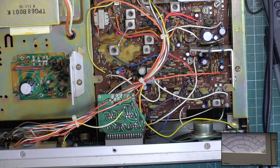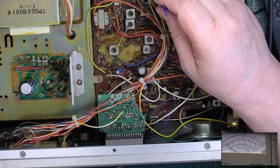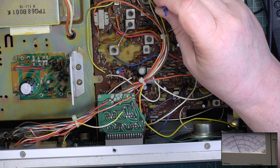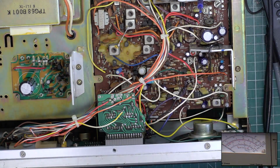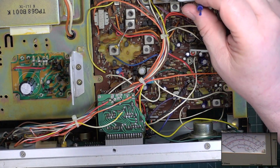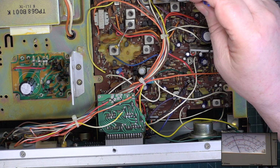So in order to balance it, we're going to have to take the yellow one clockwise so that the power just starts to move down. So there we are at 4.4, 4.2-ish. And then the green one anti-clockwise. That one clockwise is supposed to be for 4.4, but we can't achieve 4.4, so we do 4.2. And then the green one anti-clockwise, the manual says for 3.8 watts. Remember, they've got to get them through customs, but we're going to give what you're allowed, which is a full 4 watts. And remember, 4 watts on my test set will be 7 watts on a hobby meter.